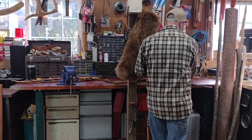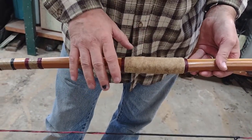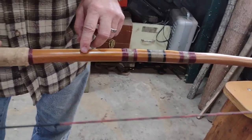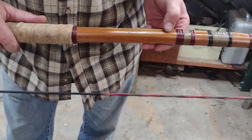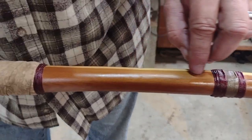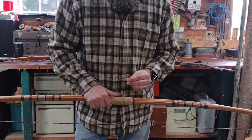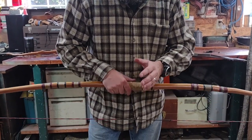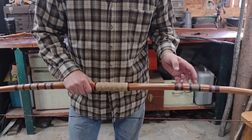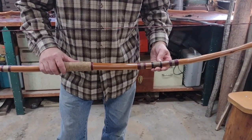Here's another one — a Pacific yew. I started making this bow and while I was tillering it, before I'd even finished it, it had what's called wind shake. If there's strong wind or damage during the tree's growth, you get a dark black line through the growth rings. Those growth rings don't bond together, and the wood can split apart just like a laminated bow delaminating. It split right through the center of my limb.